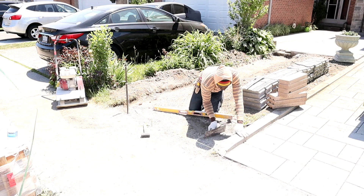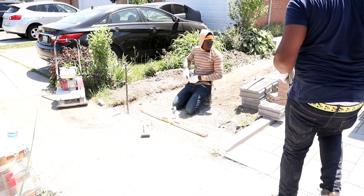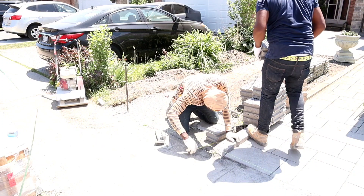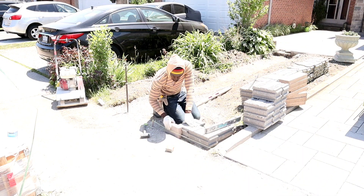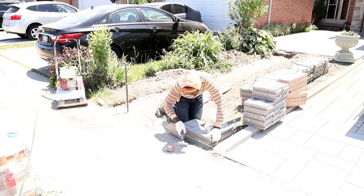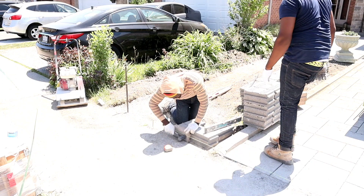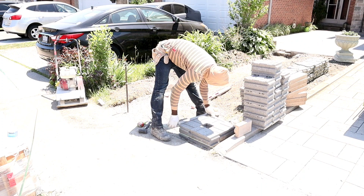We have part one of this video where we explain more depth — I'll have that link in the description. So there I'm trying to measure: I run a line from where I want my wall to catch level with the paver over there close to the doorway. I catch the measurement — the stone itself is six inches — and I'm just squaring it, running a line across to line up this column with the previous column already laid in part one.